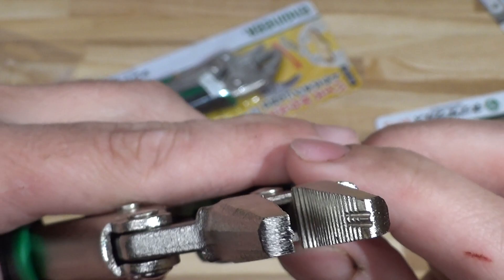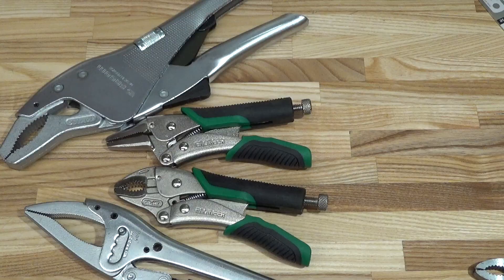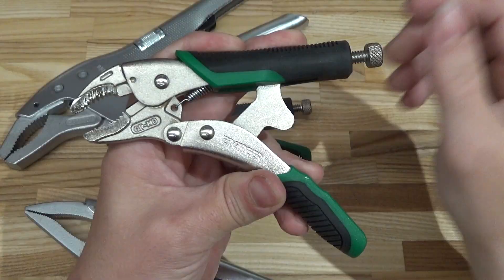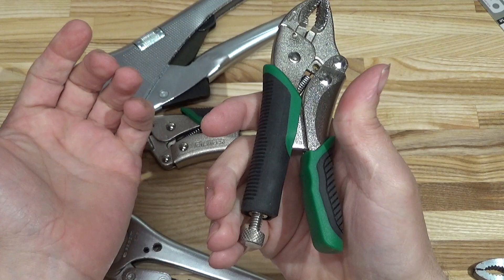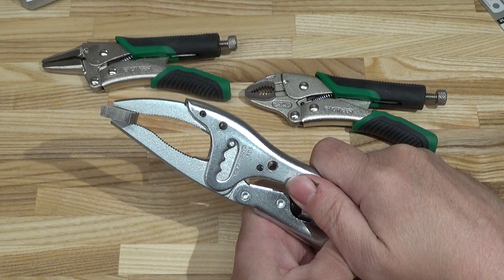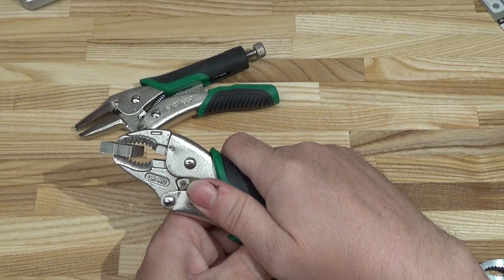Take a look at their jaws. In comparison to my current locking pliers, these new Japanese models are really compact and have much less play in their jaws. These new compact gripping pliers nicely complement my existing pair. Function is similar to a typical locking plier — you've got an adjustment nut at the end of the handle, clamp it down with a click. One difference is that it doesn't have a release lever; instead you just have to prise it apart with your hands. Not too difficult for small pliers like this. Larger locking pliers without a release lever can be more challenging because the tension is higher, and when you release them it tends to throw the part. These little guys tend to be a little bit easier to release.